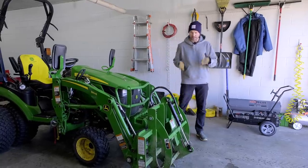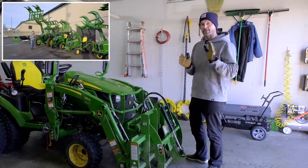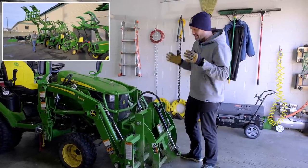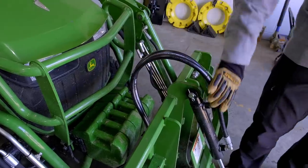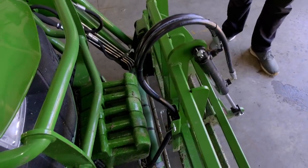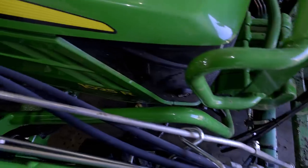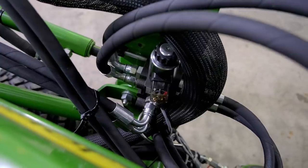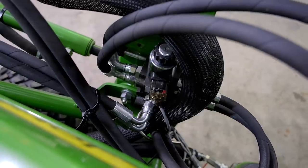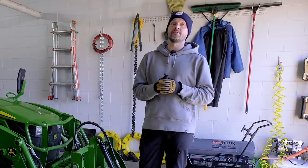What you see here is a grapple sized appropriately for a small tractor. There's a whole video about selecting the right one, but this is a very common reason you want a third function. See these hoses coming up? They're tied into that diverter kit — that third function capability — to be able to open and close the top jaw. If you don't have that capability, you can't operate the grapple. You could go the electric grapple route or even get a brush crusher if you want to avoid the costs altogether.